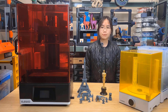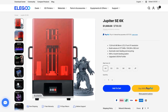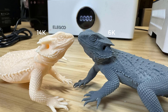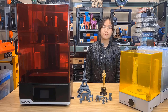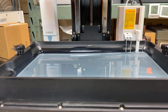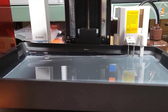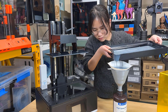In conclusion, there aren't many choices in the market for a budget large-size resin printer, and the Jupiter SE stands out as a fully functional machine with a solid build at the lowest price. While its resolution is only 6K, when you print at a 0.05mm layer height, the details are not far from those produced by a 14K machine, so this won't be a concern. However, if you have high expectations for a fully automatic resin management system, that's not the case. The resin feeding feature works okay — it's especially useful for big prints requiring more than a 1kg bottle of resin. But the recycling feature only sucks up around 80% and requires you to pour the rest back manually, which may not be a game changer.